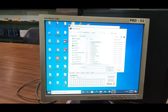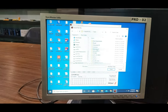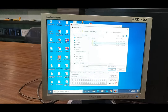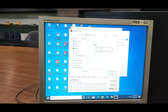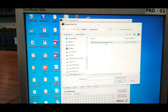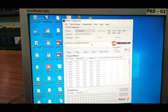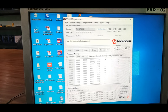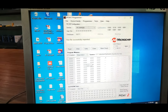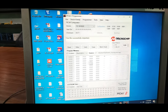Open the code folder and we will start programming with the DIP switch program. Go inside the dist folder for hex programming, since we are using the ISP programmer here. Open the default folder, then production — this is where the hex file is located. The hex file is successfully imported, as shown by the message. The hex codes also change; previously all memory locations were blank, showing FF.